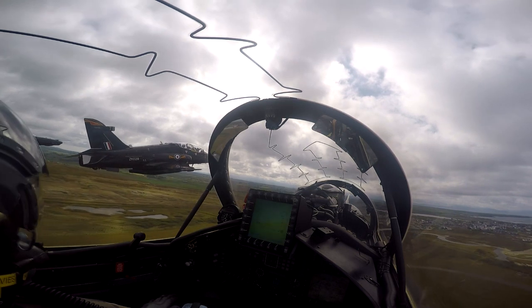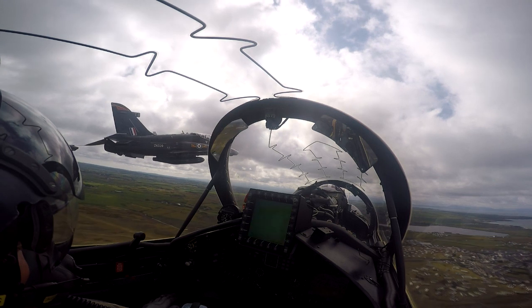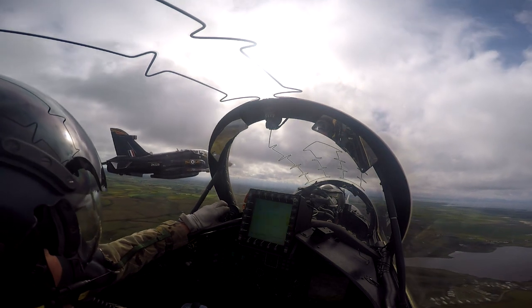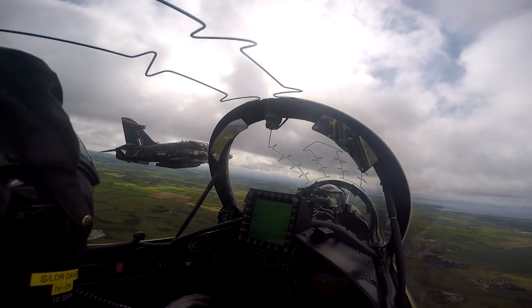We'll check that the gear is up by 200 knots, and the flaps are up by 250 knots, which is their limiting speed. Then we'll check that the central warning panel, where all the warnings are, has nothing lit. We'll also check that the auxiliary power unit, illuminated by green APU lettering, is off — sometimes we use it in the summer to cool the avionics.